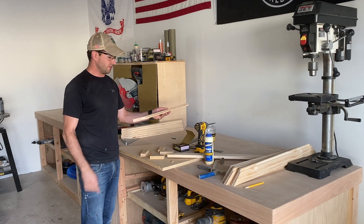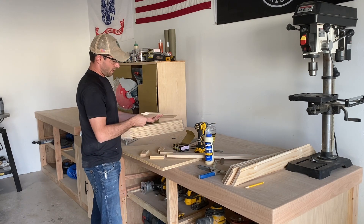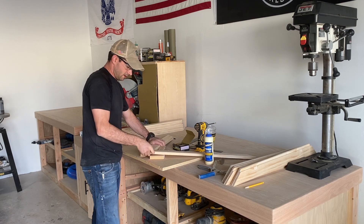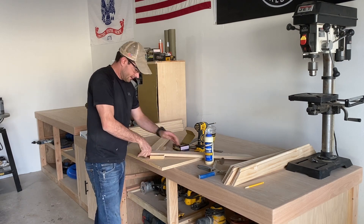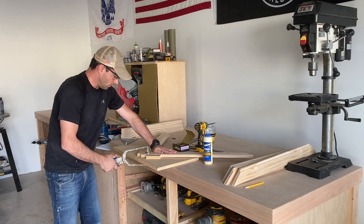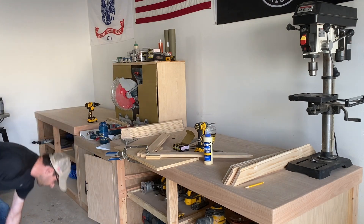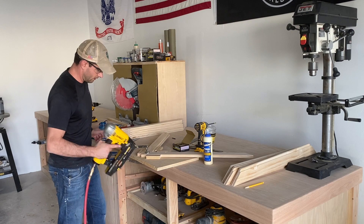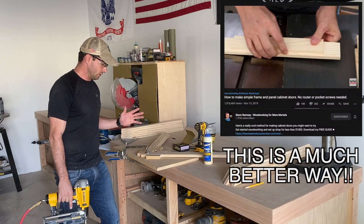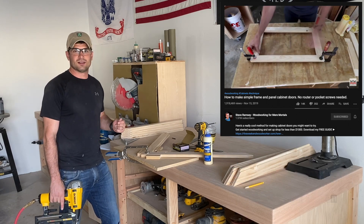How I'm assembling the door frames: I built this 90-degree jig, and I've got the sides and the top and bottom pieces. I'm gluing and adding a biscuit joint to this 45-degree miter, then assembling them in this jig, adding a clamp, a screw in the pocket, and then using a nail gun here and here. Why so many attachment techniques? I did this the first time and it was a nightmare — everything was still loose. So this is not the best way to build a cabinet door, but live and learn is what it is.